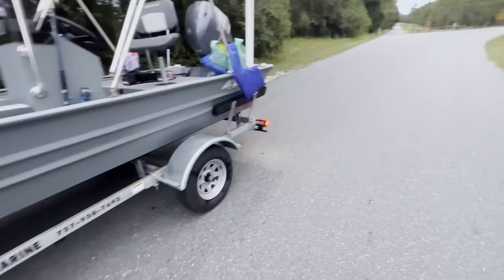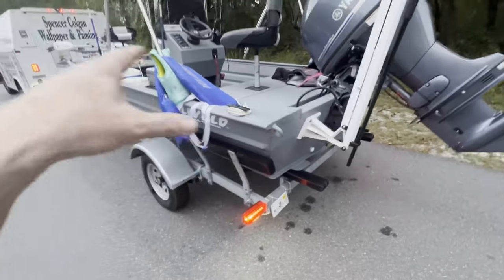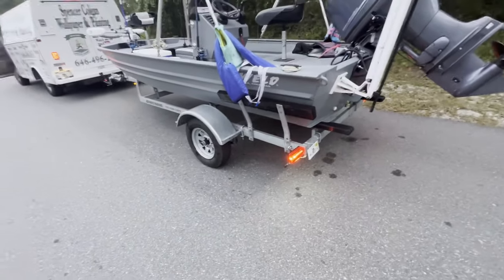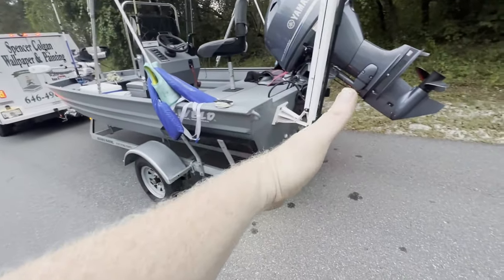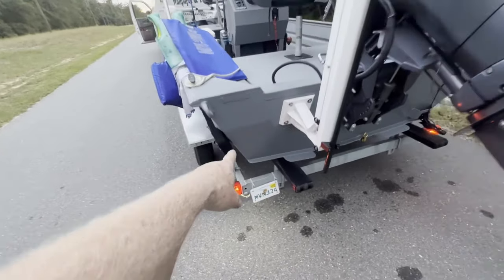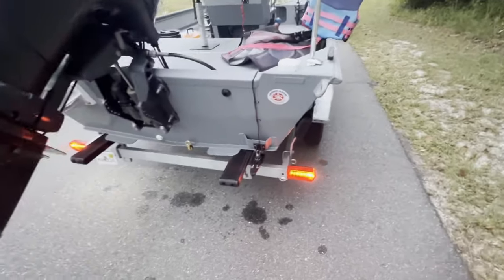Let me say one last thing. If you do this in the dark, promise me that you will make sure that the boat is actually on the trailer. It is possible, if you're in the dark and your trailer is too submerged in the dark water and you don't have a light, that your boat will be sitting at an angle that puts the boat on the trailer but not secure in the trailer. It is possible to pull that winch and be riding on top of these rather than inside of them. And then what happens? You get a mile and you drop your $40,000 boat right onto the pavement